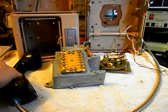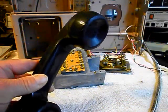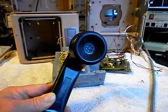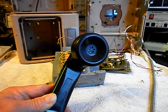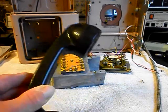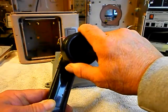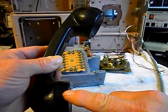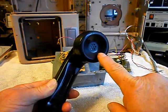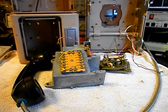Now we want to show you the receiver. We're going to go in and check the transmit, but we know the receiver is bad. There's a big crack around the receiver capsule cap. Probably what happened is somebody either tried to get into the receiver capsule and remove it and broke the cap, or it was slammed down and broke the receiver capsule inside and the cap. We're probably going to have to replace this cap, but they glue the caps on these handsets for payphones so they're very hard to remove. This one will probably break anyway when we try to remove it.